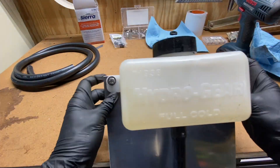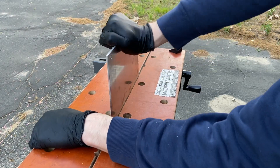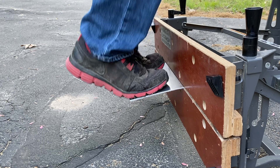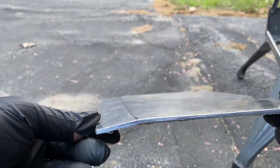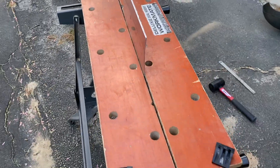Sadly, I don't have a press brake, so I'm going to clamp the aluminum sheet in this work table and see if I can bend it. Bending it with hand pressure doesn't look like it's going to work — the 1/8 inch aluminum is a bit more sturdy than I anticipated. No problem though, all we need is a little more pressure. Kind of cheesy, but jumping on it totally works. I'm happy with my first bend that will attach to the square tube on the mower. Now I'll make a bigger bend higher up for the surface where the tank will attach. Just a few more jumps and we're good to go.